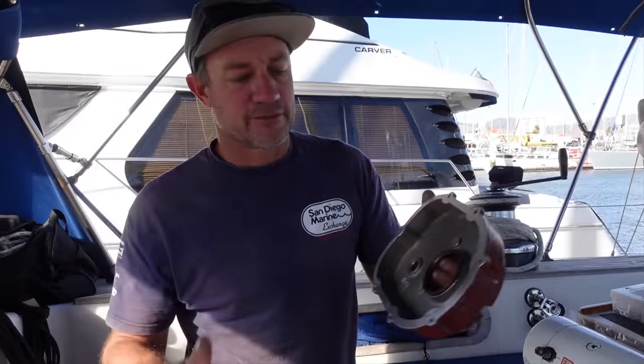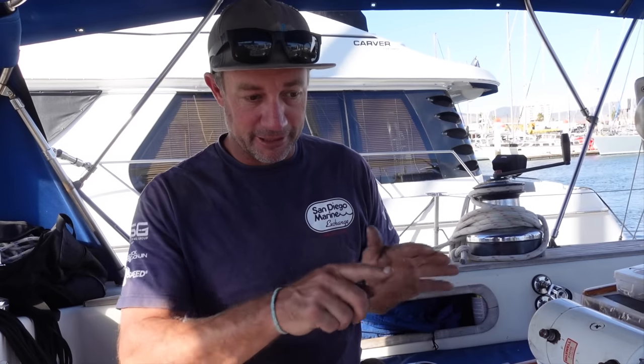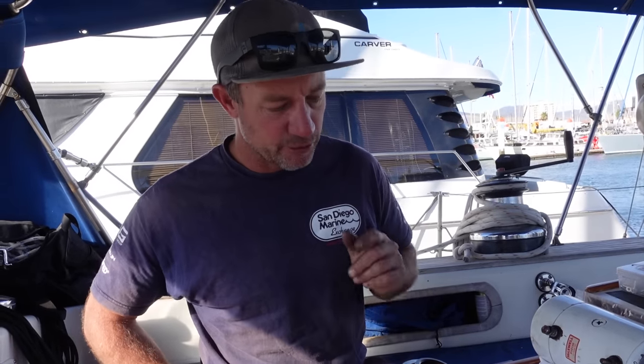I don't want to play too much with that because that's a machine surface, but I will use a 515 Loctite on that, and that should give me a seal. I was nearly tempted to make a gasket just because of the couple of nicks here and there, but I think we'll be right. That's about it. I won't bore you too long.